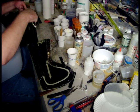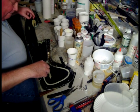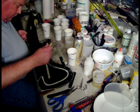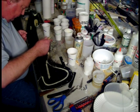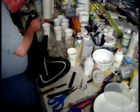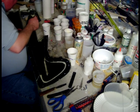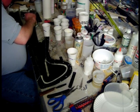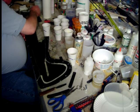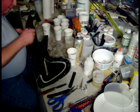We're going to put in this 50k tow. You really have to check and make sure that you got the air bubbles out at this point, because once you close up that mold it's really hard to see inside. As a matter of fact, I try to work the seam as little as possible, because the more you work the seam, the more bubbles you pull in.